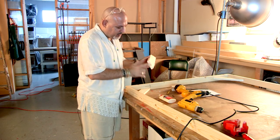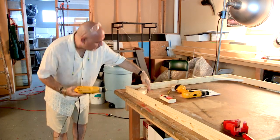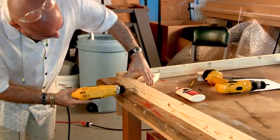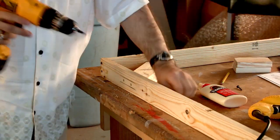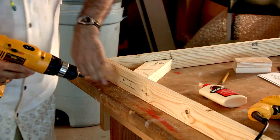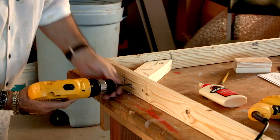Put a little bit here, a little bit there, and you're good to go. Place it again on that second block of wood just like before. Now I'm going to go ahead and drill the holes, making sure that this is flush against the inside of the wood exactly where we had it before. Once you have your pilot holes, just line things up and screw it in. Make sure that it goes below the surface of your wood so that when you tighten the flats with a C-clamp with one stacked in a row, these won't get in the way and you'll have a nice tight seam.